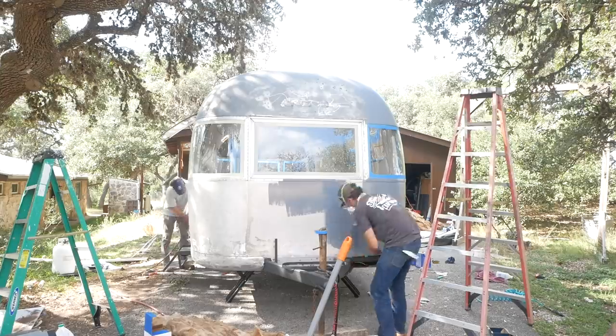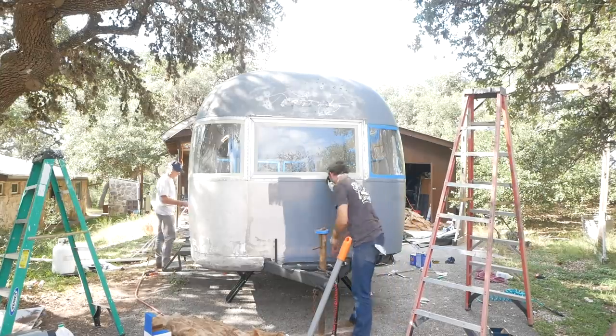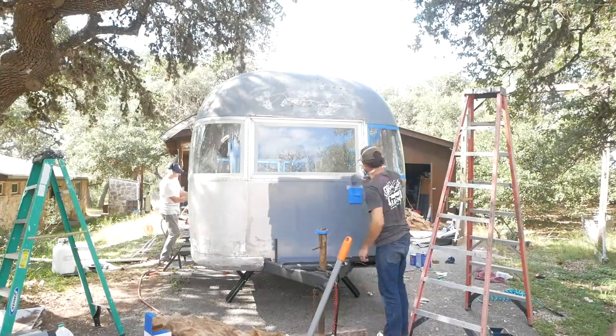I mixed up a full gallon of a two-part epoxy from Total Boat Primer, a really solid product, which I will link in the description, with the intention that it would cover the top. Well, it covered the top with probably 7/8 of a gallon still left. So at that point, I just had to scramble and try to paint as much as I could, because it's an expensive primer, and once you mix it, you got to use it.